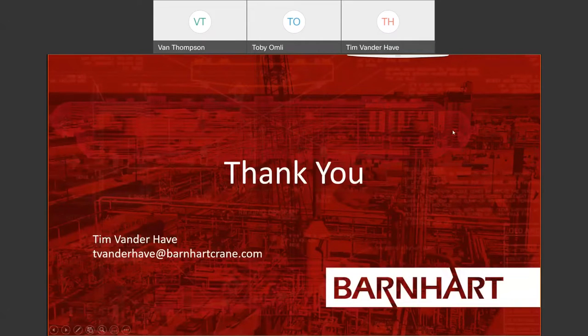Tim, thank you for the presentation. One question coming in is: how do we determine whether the facility we're supporting has the integrity and capacity to handle the loads we're putting down? One of the things we do is work with the engineers of the facility, or we have a team of structural engineers that we can contract in, and we'll work with them to find the load bearing points, the thickest concrete, and the structural steel. We'll determine the loads on our equipment and work with them to make sure that the area can handle it. It's an iterative process, but it's definitely part of our planning phase.